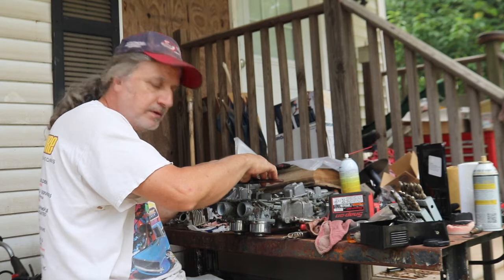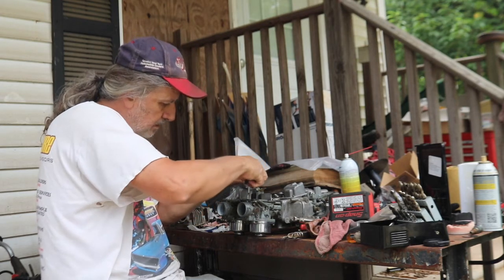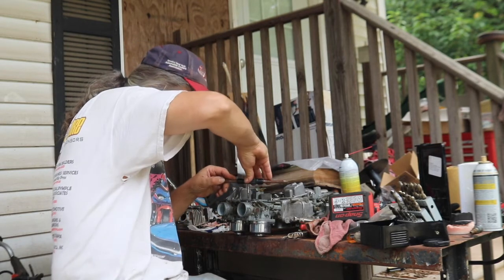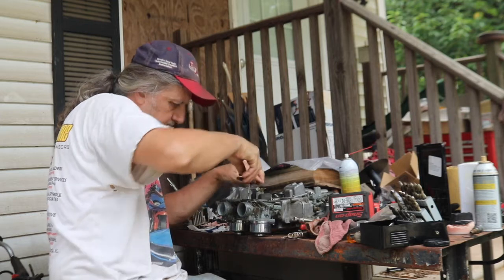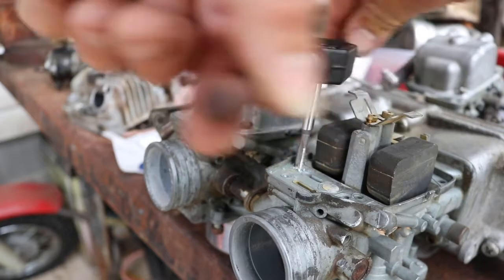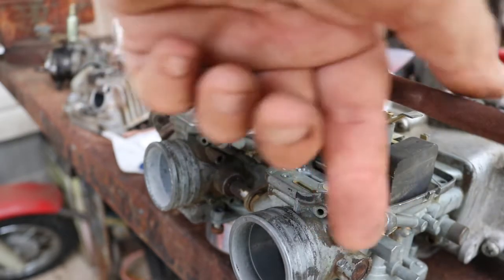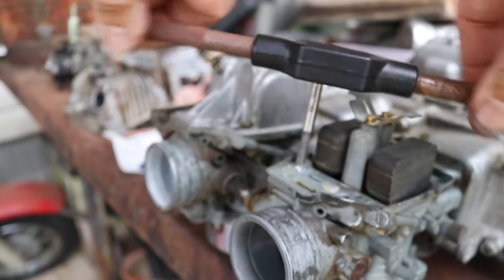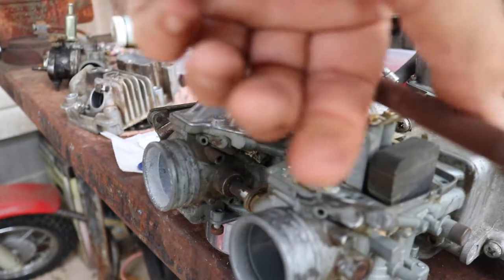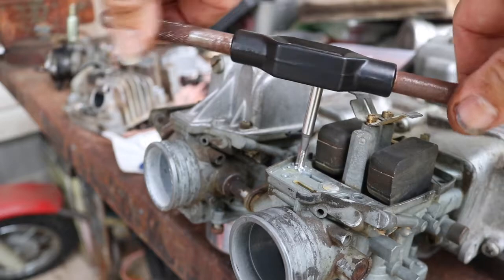It's really important to get these things started straight. The idea is you want to screw it in about a half a turn, back it out a quarter. That helps to clean out the shavings. It's really important in aluminum, because that aluminum can gall into the tap and it can ruin the hole. Then the thread insert won't fit in correctly.